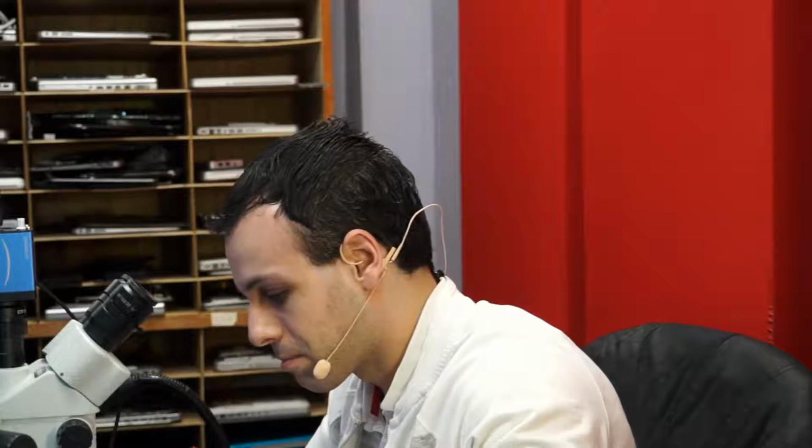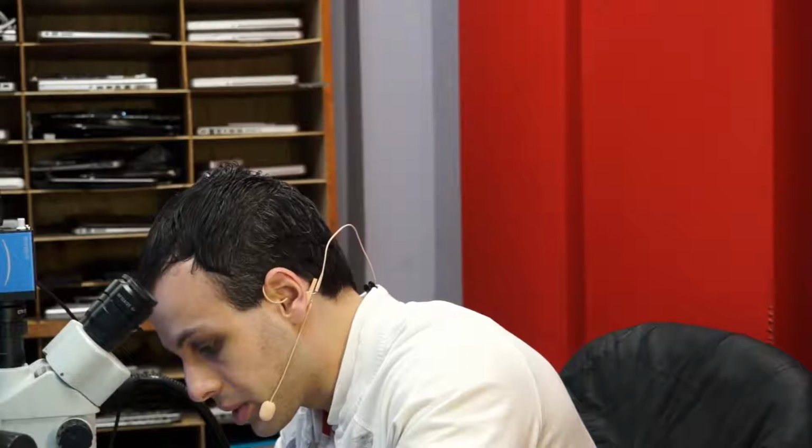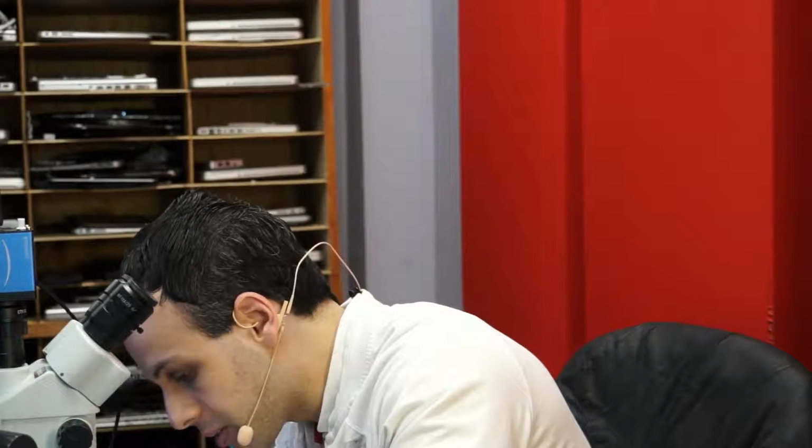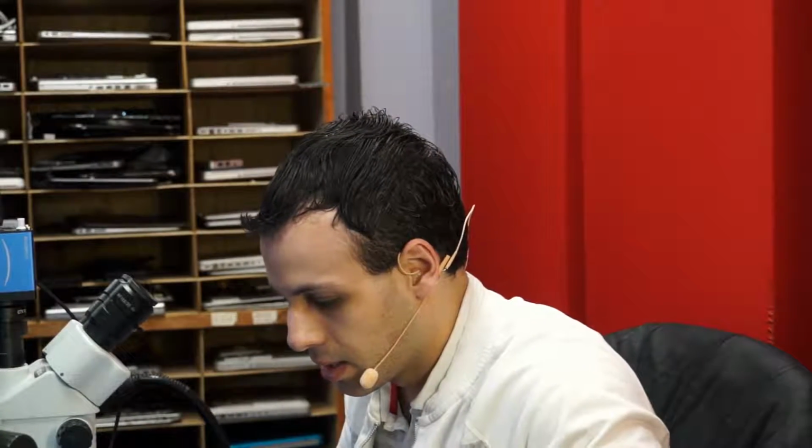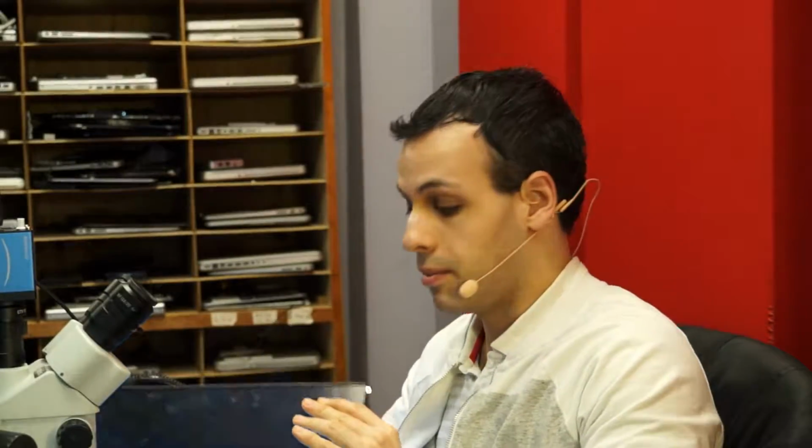Alright, so what I'm going to do over here is check the LCD enable signal so I can just quickly tell, is the screen even being told to turn on? Okay, the screen is being told to turn on, and it is. That's right. Fuck you. Pox on you electronics engineers. Pox on you non-practicing people that tried to curse me through the damn screen. Check it out. Screen. It's lighting up, which means I have vcore, which means I'm good.